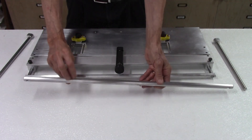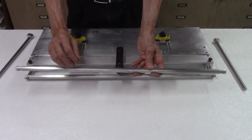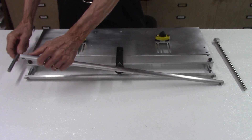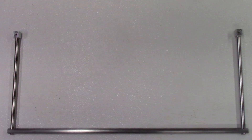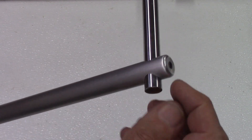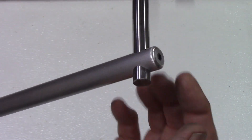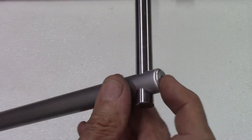These rear support bars are constructed from an aluminum bar 26.5 inches long by 5/8 inches in diameter. There are 0.473 inch diameter, or 12mm, holes — one in each end of the bar. These holes are needed to attach the two 12mm guide bars, one in each end of the table. On the end of each rear support bar I've drilled and tapped a number 10-32 screw hole, then inserted a 10-32 set screw to permanently attach the 12mm guide bar to the rear support bar.